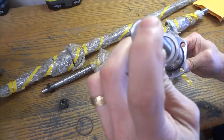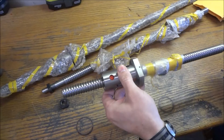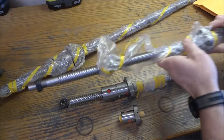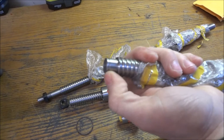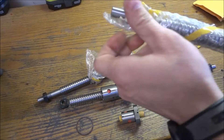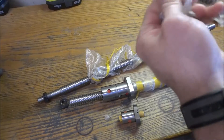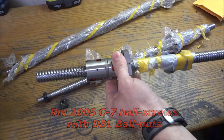I did have my ends machined to my specs. You can see he does a real nice job on the ends. This is my Y-axis ball screw and my Z-axis — really good job. And then of course my X-axis. On the X-axis I do have both ends machined; it's not going to float, it's going to be in a bearing on the other end as well as the driven end. It turned out really nice and I'm very satisfied with the work that he does.